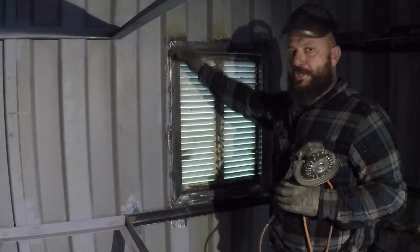I'm going to wire brush it from the outside and then I will paint it. I welded this angle and I used it to support this window to be able to mark it easily, and then I cut it and welded. I had to straighten this part over here. It was bowed inside. I beat it with the hammer and I still have to do just a little bit. I will do it later.